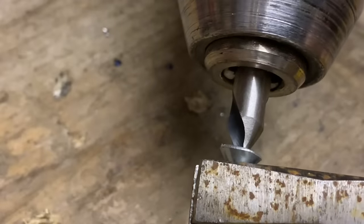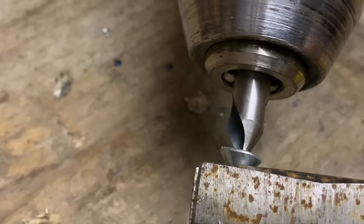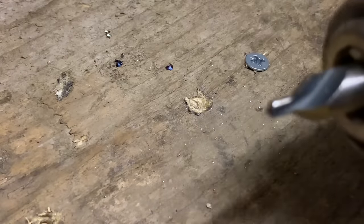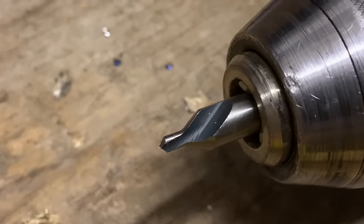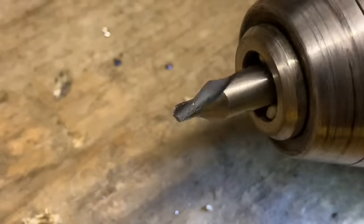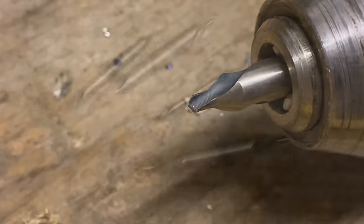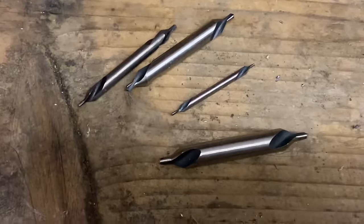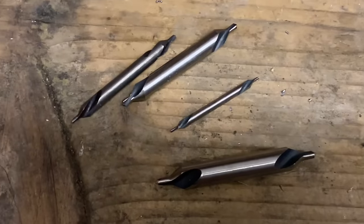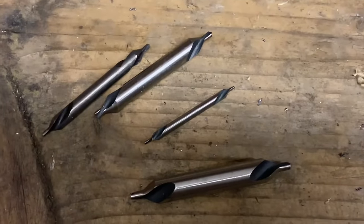We'll just put the drill into what we would normally call forwards — but it's not, it's reverse — and it just works its way out, as you can see. And because we drilled that pilot hole first, the tip is still as good as it was when we got it. So there's one idea on how to remove a properly stripped screw — no rubber bands or any of those methods you see online.